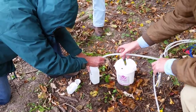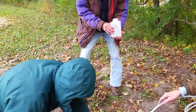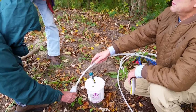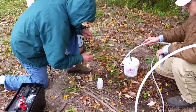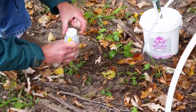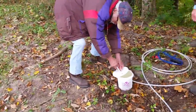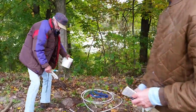We've got our sample bottles here for the different analyses. We've got it filled to the top. Now we have another sample going to the laboratory where we're going to be measuring phosphorus. We need to preserve it with acid, so we're going to add some muriatic acid. It stabilizes it so when the lab gets the sample it'll have an accurate analysis of the nitrate or phosphorus in there.